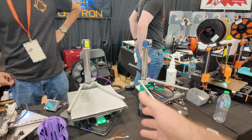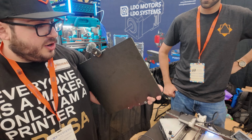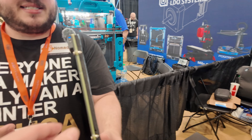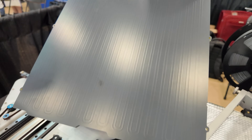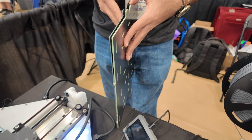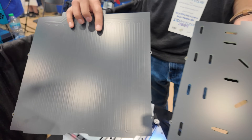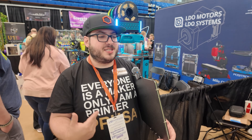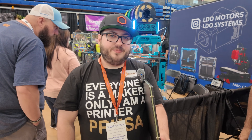We are very happy to show off the bed itself — this is our Proton bed. We worked with LDO to make this. What's neat is that this is actually a dual-layer PCB — we literally sandwiched two PCBs together to give it its strength. If you notice on the traces, there are two of them — so we have two heating zones. When it automatically swaps over to battery power, it cuts off one of the heating zones to extend battery life. But both heating zones together allow it to heat up even faster, and on failover it drops into a low power mode to last a little bit longer.